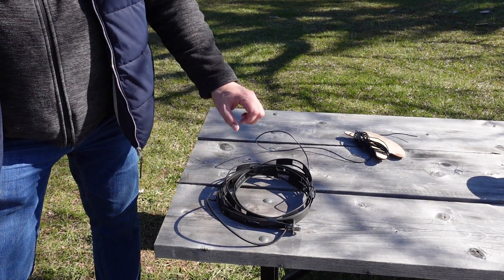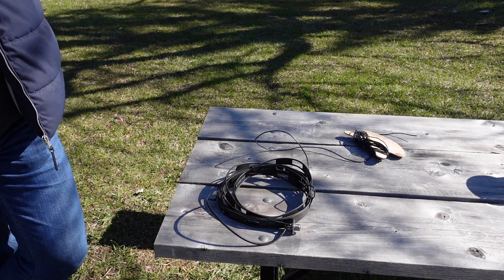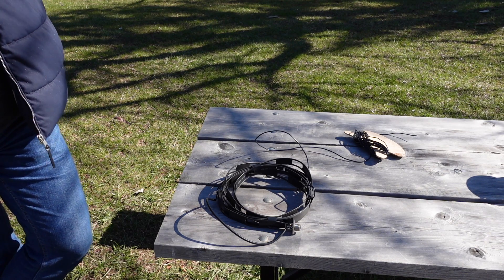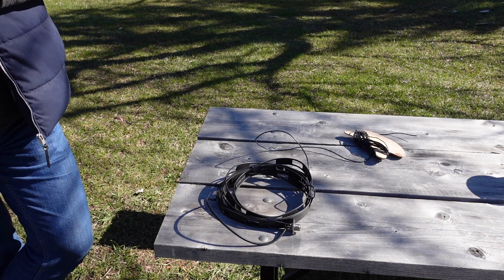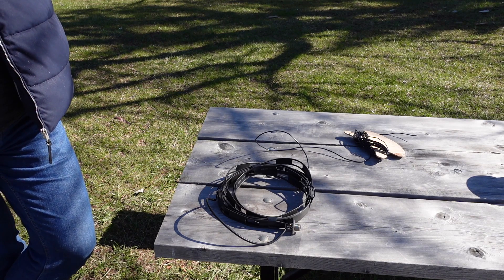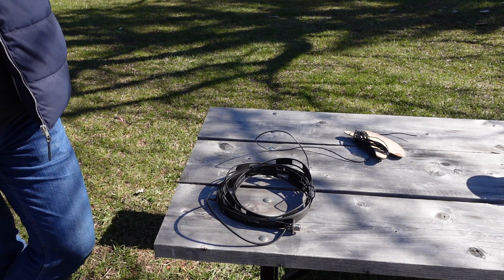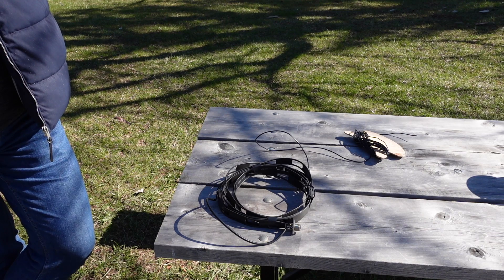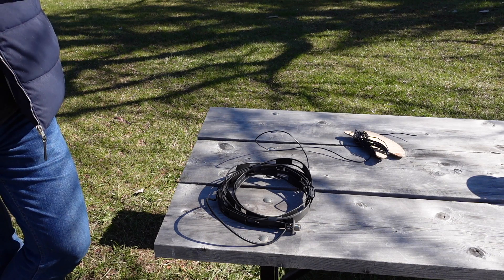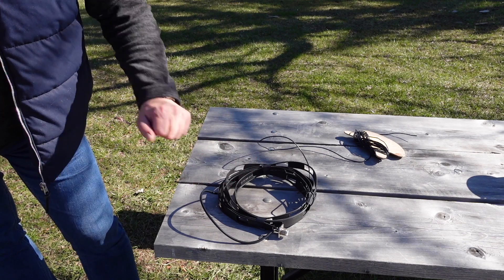It's not in the middle of the band — I cut it a little bit too short. But the reason I'm interested in it is I want to build a vertical Moxon antenna with Tracy. So if Tracy decides to go to a park and activate it, he can build a pretty compact Moxon antenna. But because it's vertical, it's going to be very difficult to feed that dipole in the center, so I want to feed it at the bottom end. That drove me into developing and tuning this matching section.